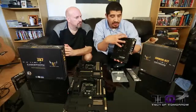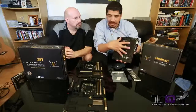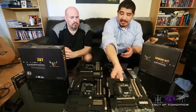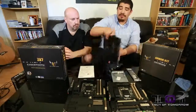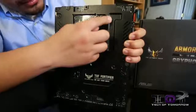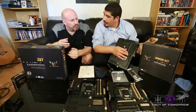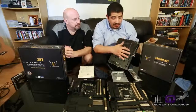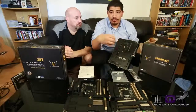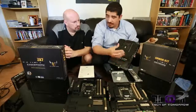All our PCBs use very high quality PCB substrate material, so there's very little flex compared to competitors where they're a lot thinner in certain situations. But this just gives you that other layer of confidence. Going back to the ATX version, which also features the fortifier design, we can even have it serve as an actual heat sink. You're going to see right here that it's making direct contact with the VRM heat sink, giving you additional cooling on top and below the VRM. The hottest part of the VRM is your MOSFETs and your drivers, and this is directly making contact with them to pull heat away and disperse it across this entire section. That's another benefit the fortifier gives you.